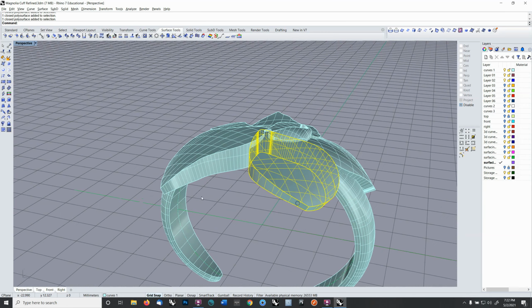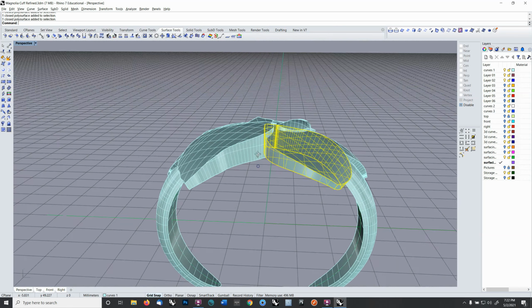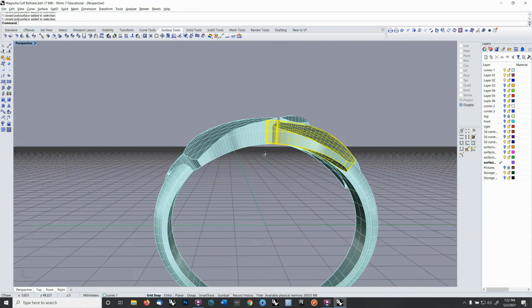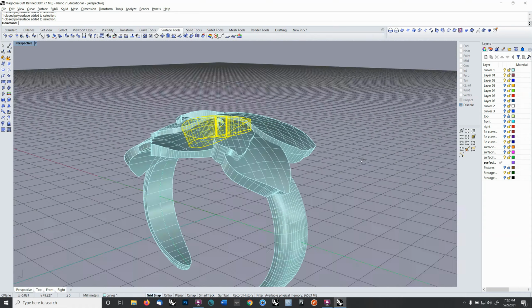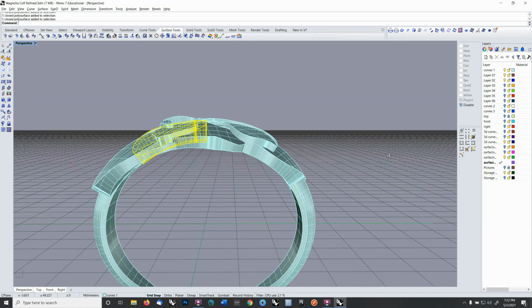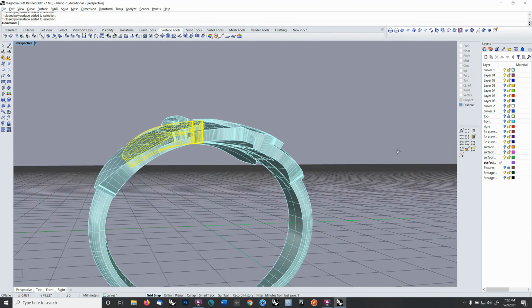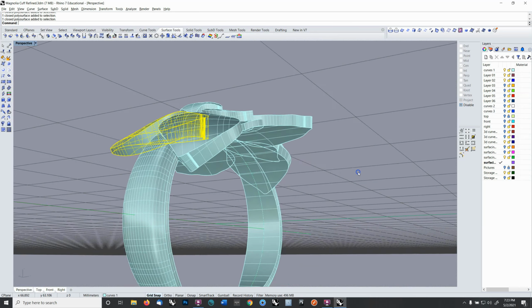I think instead of a straight extrusion coming down here on these thicker petals, I'm going to first off consider doing an offset surface on the thicker one here. The challenge is casting. There's a limit to how much tolerance the casting is going to take. So that's kind of problematic. And there is a limit to how thin these can get.